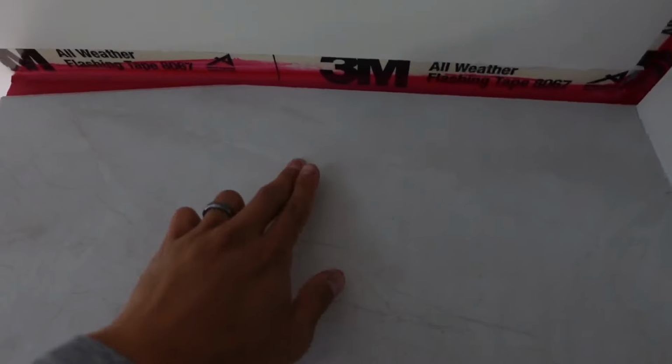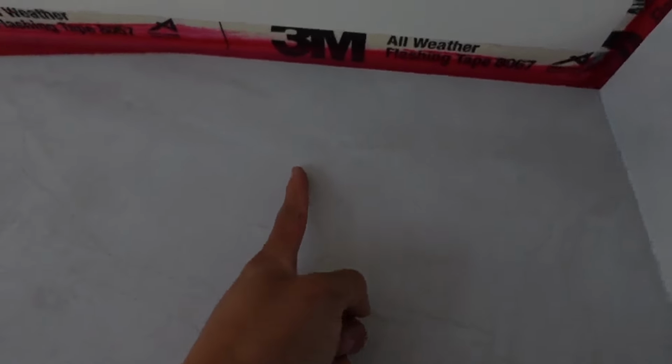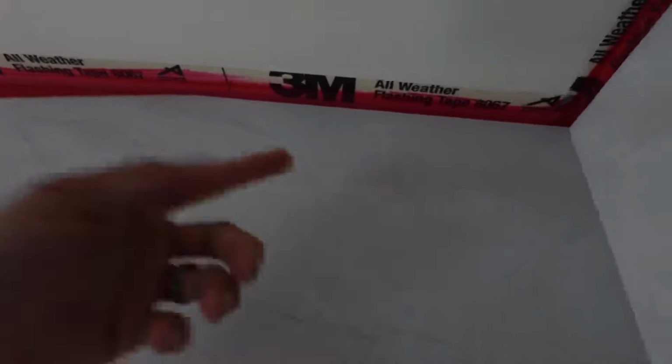So there's probably only a difference of about 1 inch between the two. So up here, I think it came out to 20.5 inches. Down here is 22.5. So if we were to install them both center, our valve would be here and then kind of on this side to the left. So I think it'll be okay just to keep it center with this. So in that case, 11.25 from our left edge in, we're gonna take that straight up. So 11.25 in from here will be perfect, because by the time we add our Nautilus door, we'll kind of shift everything.